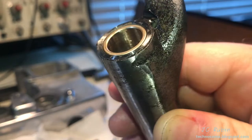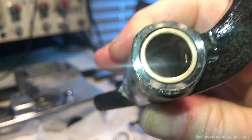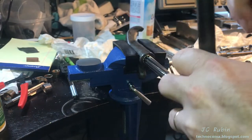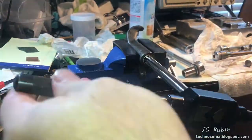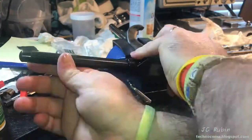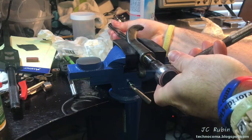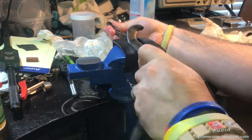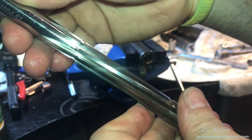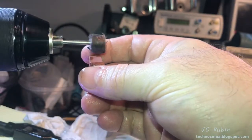In this situation, I've found that alternate passes in opposite directions gets the rocker to fit perfectly in the bushing. So I run it through in the other direction as well. When I take it out there is just a dusting of brass removed each time, giving just a little more space. To clean it, I stand the tool vertical and spray with oil while turning it in circles — you can see the microscopic brass fragments make their way down to the paper towel, a little bit less each time.